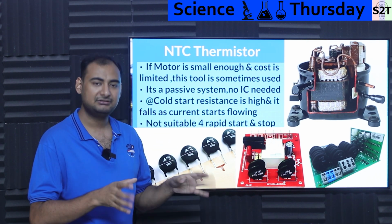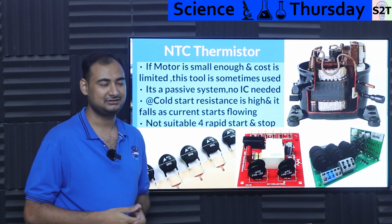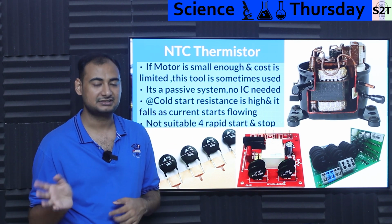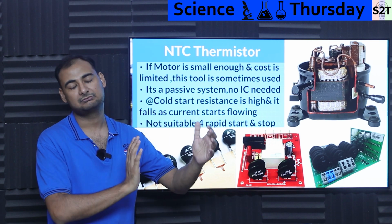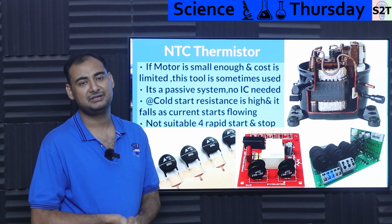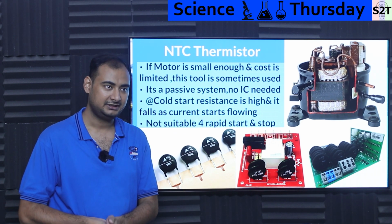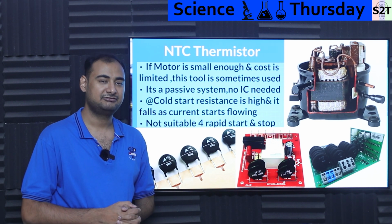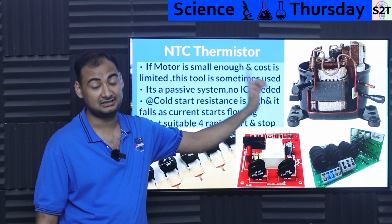But even though it's normal, we rarely have the idea of connecting a fridge to it. The reason for that is I did that. I connected my quote-unquote old refrigerator that is 15 years old. Once I opened it and looked at the back of it, it had a nameplate, and the nameplate said it's only going to consume 80 watts. I'm like, dude, the small inverter I have is 600 watt rated, and even the VA is like 1100 VA. So it should be more than good enough. Yeah, it fried it because of the inrush. So these things have very ugly inrush.